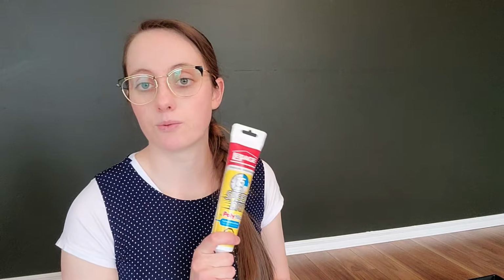And then my mud. See, I told you it's not gonna be in order. I just use this mud. And then I have a wood filler. I do wanna fill the nail holes in my baseboards and trim around the windows and stuff. And a sanding block to sand everything down wherever I patch things. And then tape. I don't know how much I'm gonna be using this, but I prefer edging with my paintbrush instead of tape because it seems to always bleed through. So if I can get straight edges with my paintbrush, I prefer that.